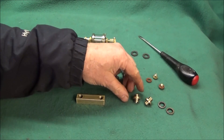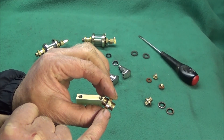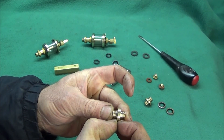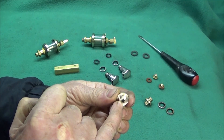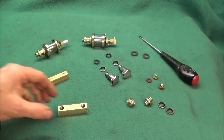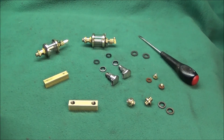Next I made two brass adapters with a 1/8 BSP male thread on each end. The thickness of the centre piece is about 4mm and I drilled through with a 4mm drill. Before assembly, make sure everything is deburred and thoroughly clean.